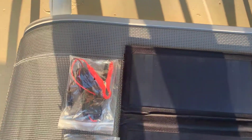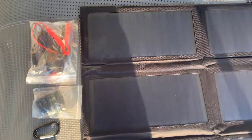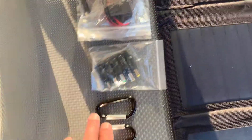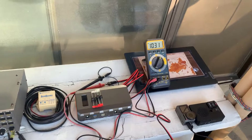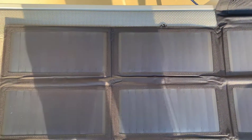One of the things you'll notice on this solar panel is that there are various mounting attachment points. You want to make sure that you hang your panel in such a way that it's directly into the sun, perpendicular to the rays of the sun. When you get the panel, they supply you these mountaineering-type clips, which would be very useful in mounting the panel. Right now I have it sitting horizontally on a deck chair, so it's obviously not the best angle to the sun — you can see that instead of 18 volts, we're getting 10 volts. It's only because it's not facing the sun.